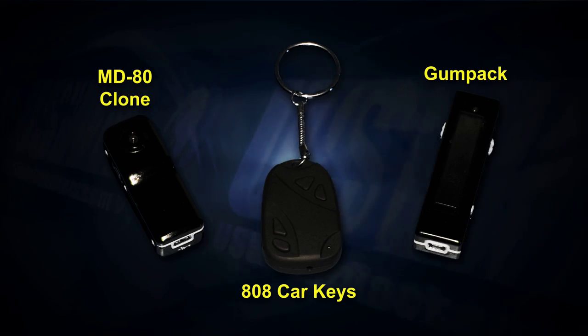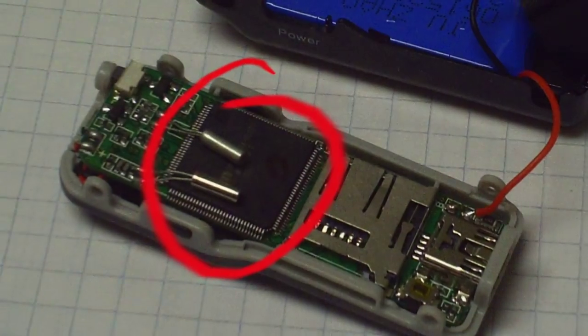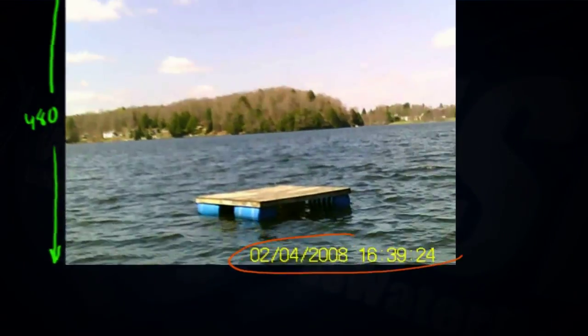To identify the correct variation of these cameras, you must look inside for a controller chip marked SPCA1527A, which records with a resolution of 720 by 480 and overlays a yellow timestamp in the lower right corner of the screen. The only flaw with these cameras is the timestamp — it cannot be turned off. Until now.